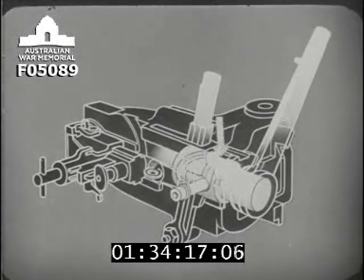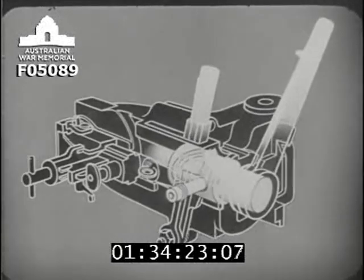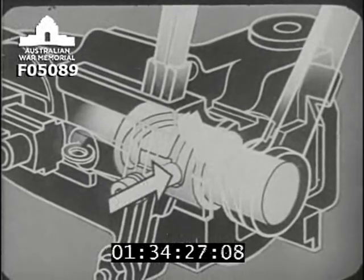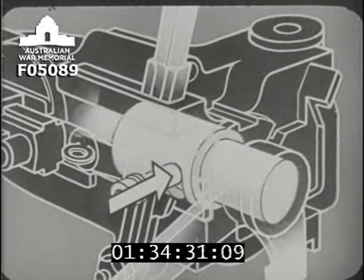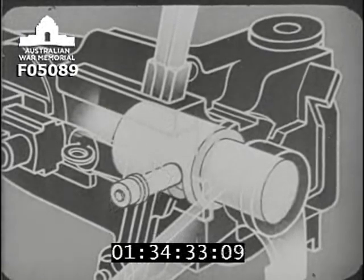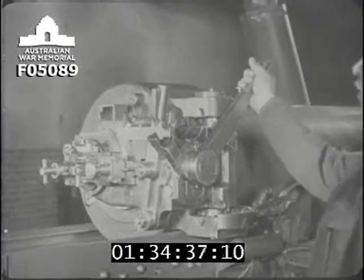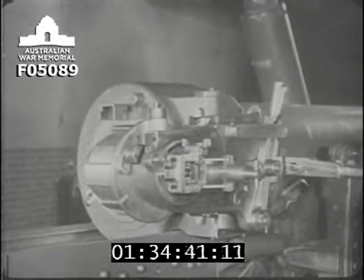This parallel cam groove enables the breech to be opened or closed with the lock in the opened position. Since the groove is straight, the catch plunger will ride round it when the cam is rotated by the LBM without altering the position of the lock. So the breech can be opened with the lock in the open position.